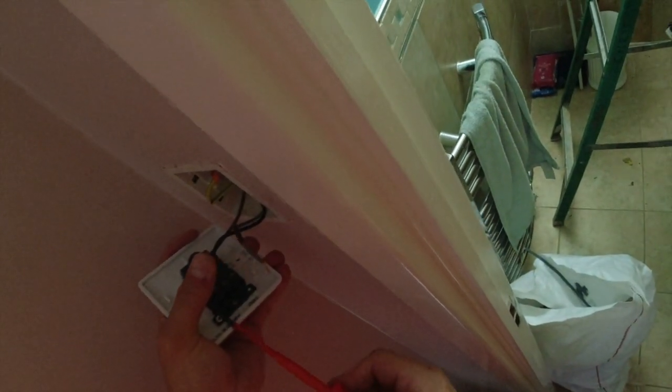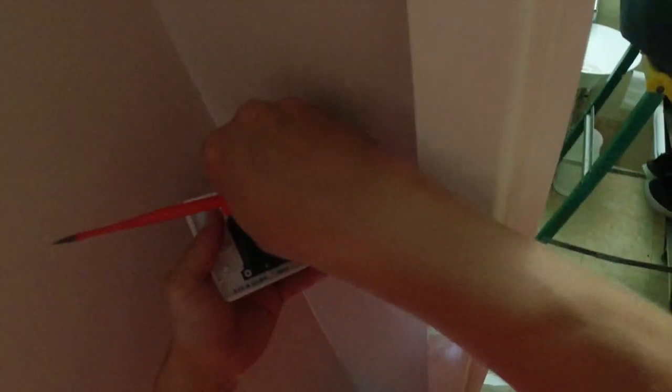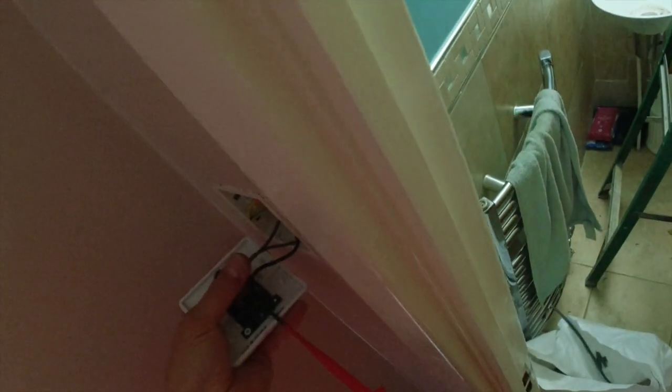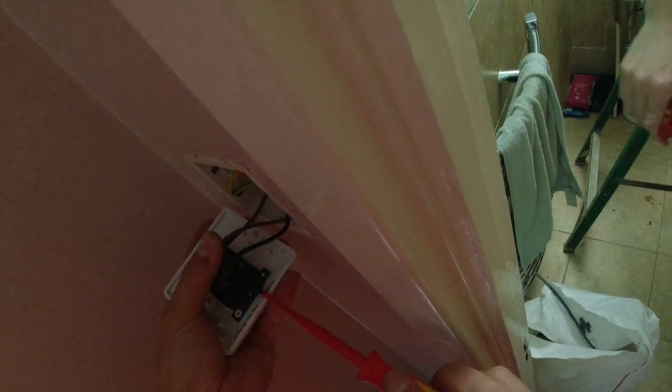We just fit a new click switch. So we go out one, doesn't matter which one. And this is 1.5. It's quite a fat three core, isn't it? It is a chunky one. So I'm not doubling it up because it'd be pointless. There's enough meat on there to put it on. There we go. Loop the feed and then the two switch lines.